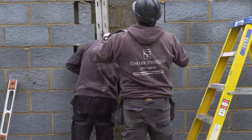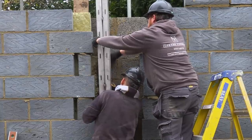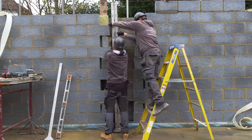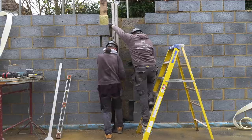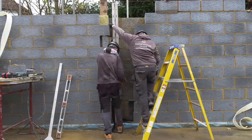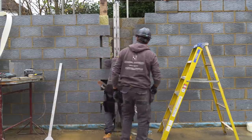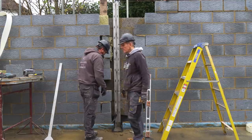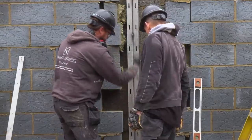We'll just lift that line over. I knew this wouldn't be easy — I think it's going alright. Get it back so that it's flush with the back of the inner skin. If we push the bottom in a bit that will help. They're going to go a fair way into the block which will help support them — we've just got to get back about half an inch and then pull the top forward a bit. We've got two bolts to go in the bottom there, then I can fill that block in, put a new bit of damp across there, and just build it back up again.